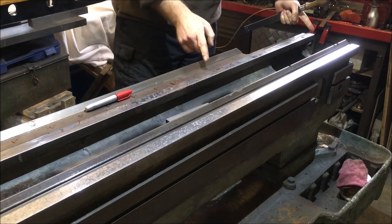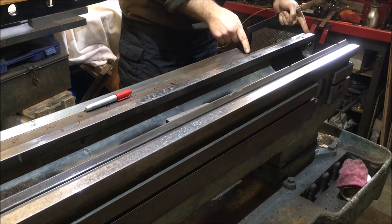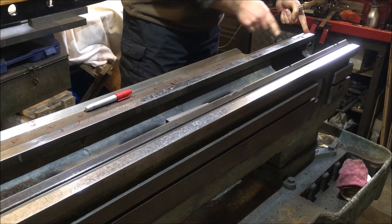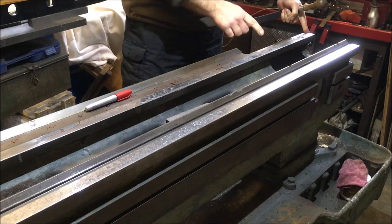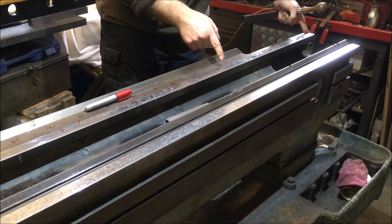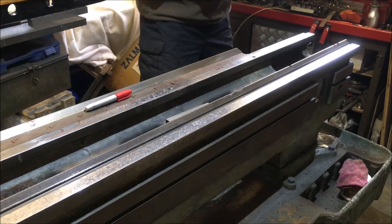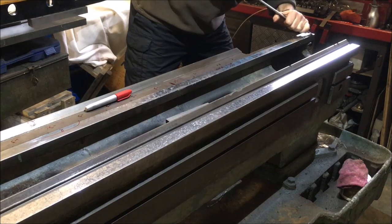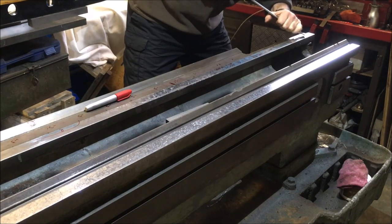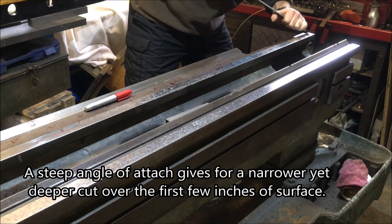All right, so this section I've got a step scrape, so I've got to go from here to here, there and back, there and back, there and back four times, and then another two to there, and then another two to there. And this scrape is absolutely bloody freezing. Trying to take about two thou out of the length at its worst.